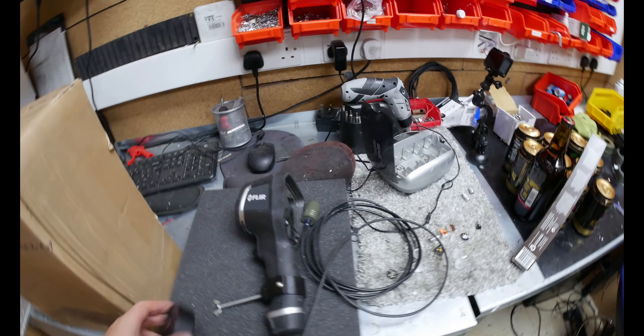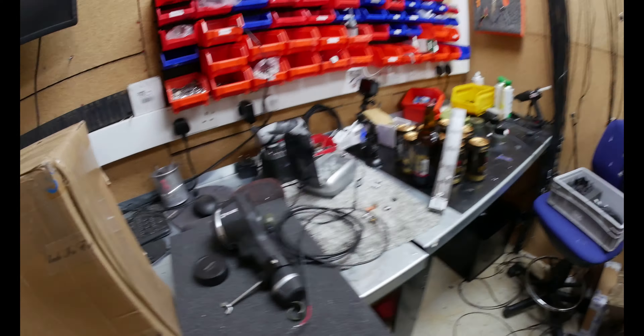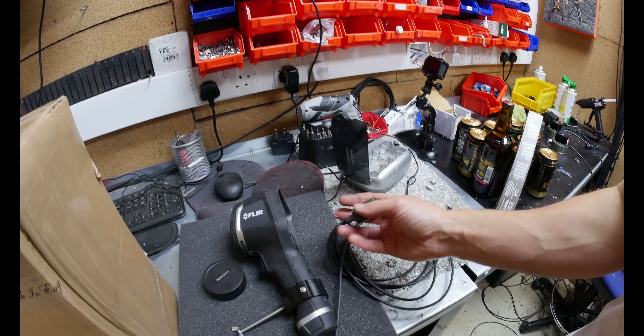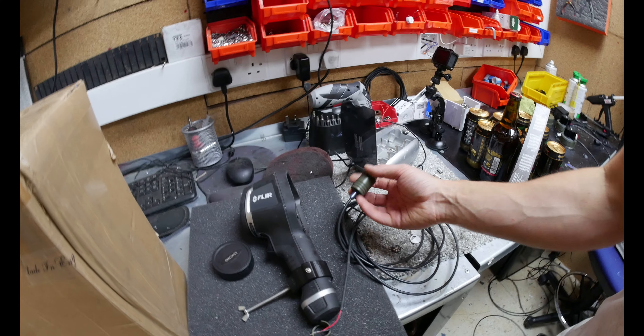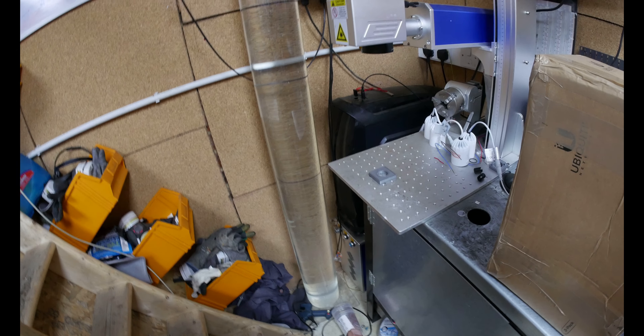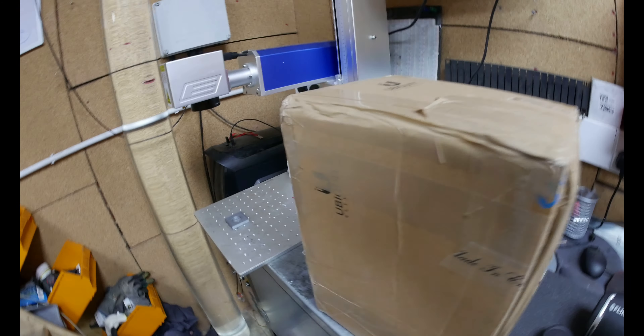It's about half ten in the evening on Thursday night and I'm just finishing off Louise Tarlin Electrical's spike light that's going to have the glare guard on it. This fitting was underwater in that tank for a little over 24 hours — I'll put in some Instagram footage to show what was going on there. And the last and most important test is the two-meter underwater test. We'll leave that overnight and pick it up tomorrow evening. And that's what you like to see — it's completely and utterly dry.